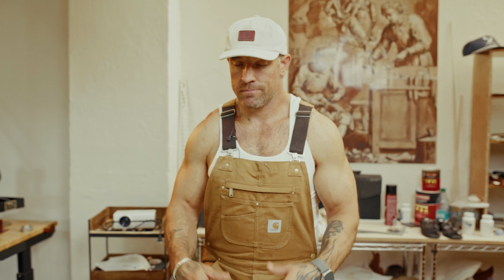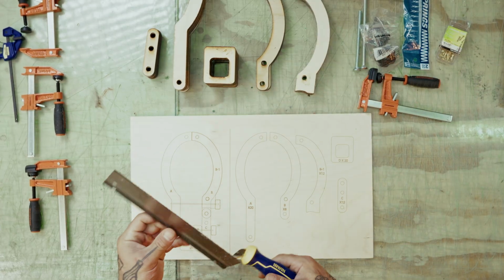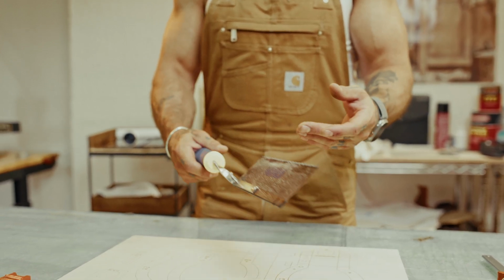If you have a Glowforge, you know how to cut these files. They should just pop in there. For this birch, I use the thick maple setting, because that's what cuts through it, but test if you need to. In terms of tools, you don't need a flush cut saw for the dowels. You can use any saw. This just makes it a little bit easier to get closer, but we are going to sand a ton.